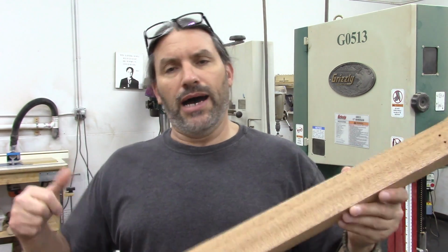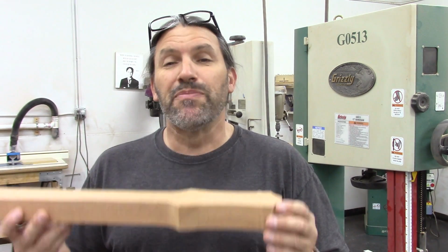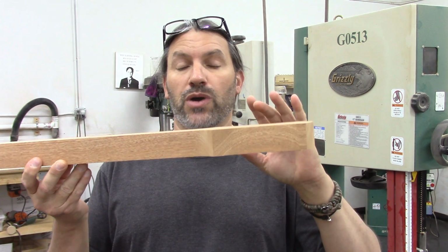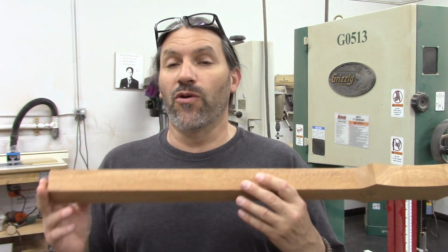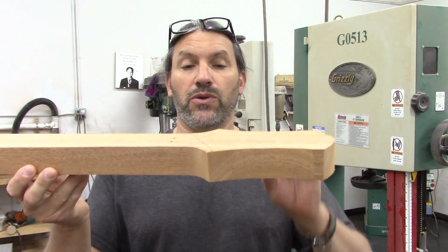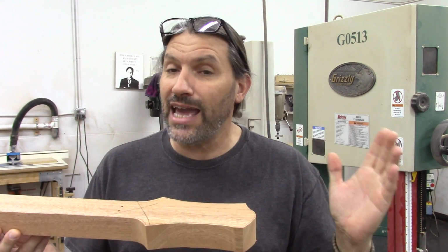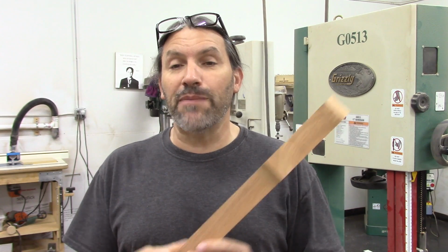Guys who say, I like to use scarf joints because you get more yield, well, yeah, you do, but it also takes more time. So if you want a one-piece neck and you aren't tied to tradition and the 17 or 14-degree headstock angle, which again, we're going to get to, using 8/4 lumber like we do, you can get plenty of angle and use a lot less lumber too. Okay, cool. All right, let's go over to the shaper and turn these into neck blanks.